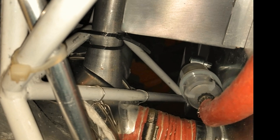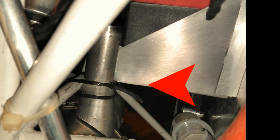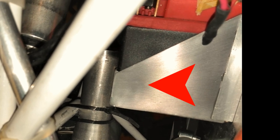A common way of doing this with an air-cooled engine is to draw heat from the exhaust. I tried this, but the arrangement wasn't effective and a bit cumbersome. A tube sat over the muffler box and a flap valve under the float chamber allowed some control, but it didn't work very well.